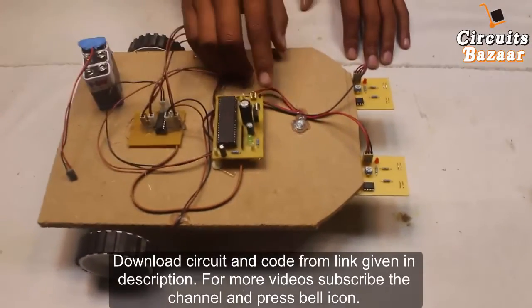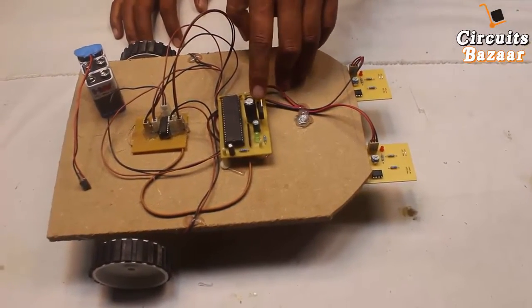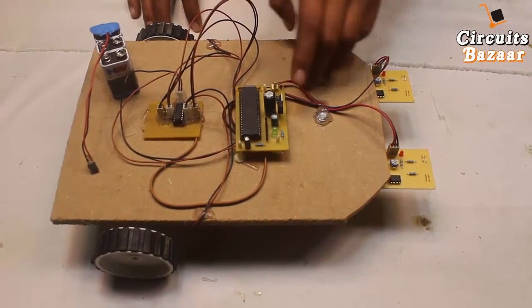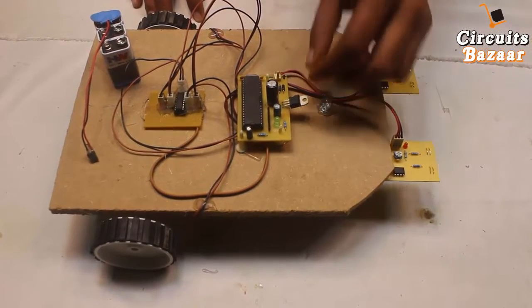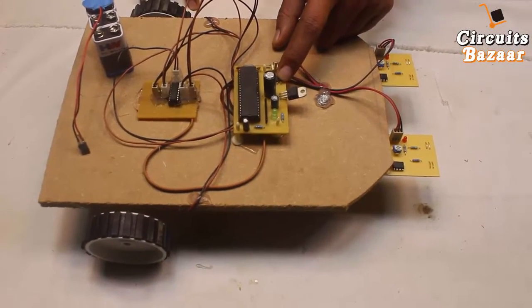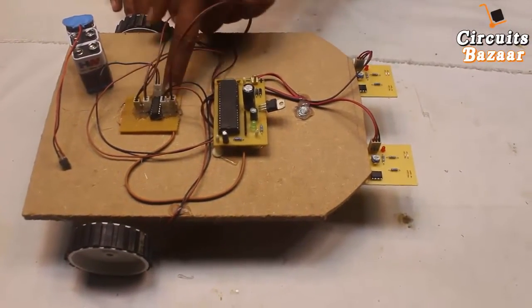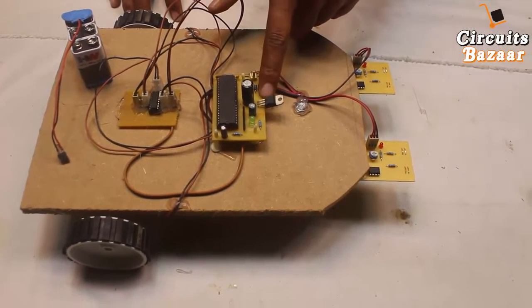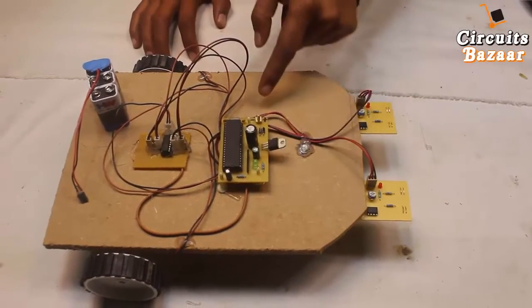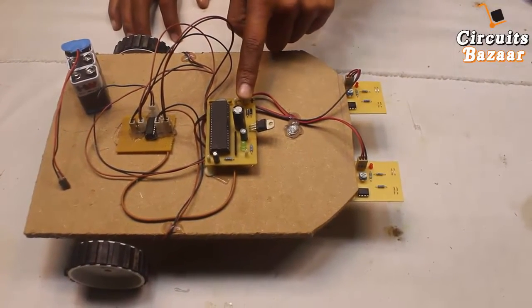If you don't have a battery but have a transformer, you can use that as well. We have used four diodes acting as a bridge rectifier — these four diodes will convert the AC coming out of the transformer into DC. That DC is further applied to a filter circuit, because the output of a bridge rectifier is not pure DC — it has ripple and fluctuations. Those are filtered out by two capacitors acting as a pi filter. Since the microcontroller, IR sensor, and main IC power supply work on 5V, we have used a 7805 voltage regulator to convert 12V DC into 5V DC. This power LED shows that you have successfully converted to 5V. You can apply 9V or 12V — it doesn't matter. You can use 12V battery, 9V battery, or 15V battery.